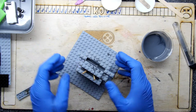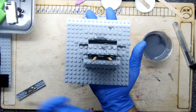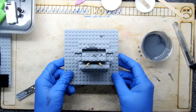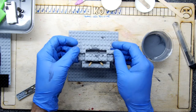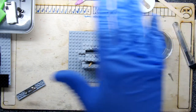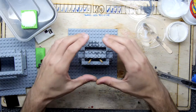Oops, stay there, stay there, stay there. So that's it now. It's full of the silicone and hopefully relatively bubble free. So I'm just going to leave this in here for 24 hours and then we'll be able to retrieve the object out of the mold. So yeah. Hang with me and we'll visit this in some sort of, you know, fancy jump cut. The time has elapsed.